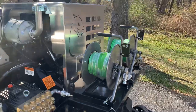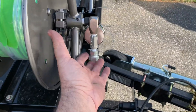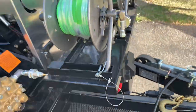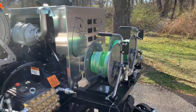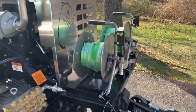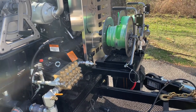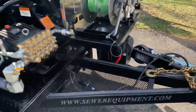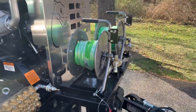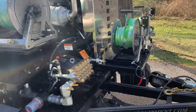This one's got an 1/8-inch and a 1/4-inch mini-reel attachments on the front. These lift off — you just carry these right to your clean-out. Your 1/2-inch jetter hose attaches right there. You just pop them off, unlock them, and carry them into the house or whatever building you're jetting in. You can also get a 3/8-inch hose cart — it's 200 feet of hose. These have 100 feet of piranha hose on them. Since the 3/8-inch hose cart is a little heavier to carry around, it comes on a wheeled cart and can be mounted right here, with the mini-reel then mounted on the other side.